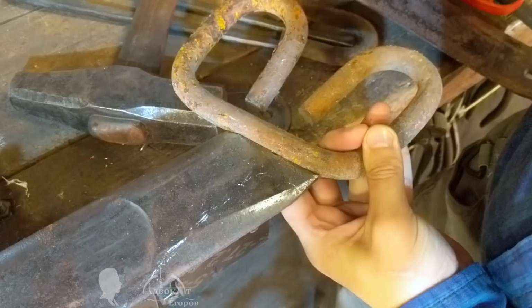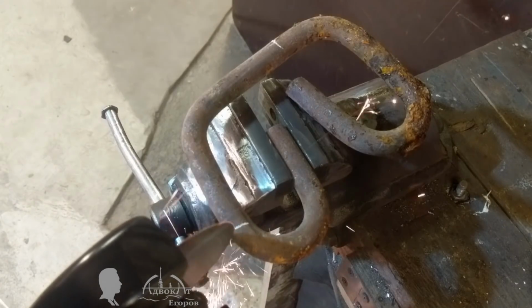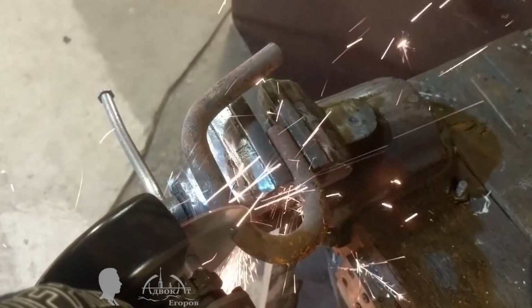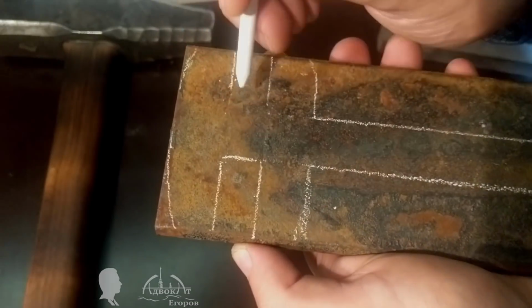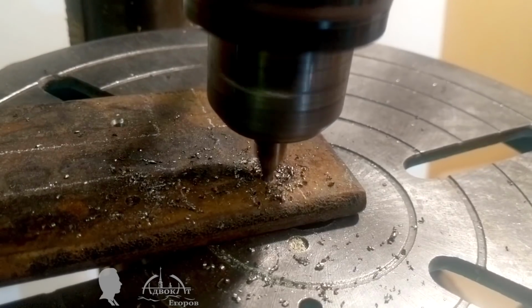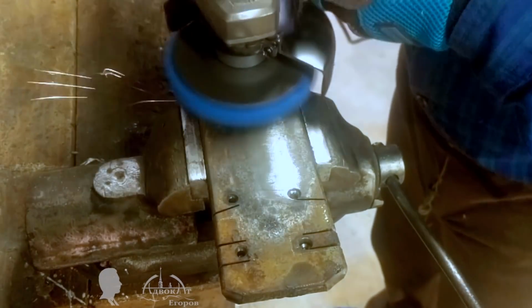Now I'm dividing the railroad clip into 3 parts. I used the central part as a mounting pin, the pivoting point of the future Cloggers Knife. As for the larger piece, I forged a tapered punch tool from it. Because the railroad clip is made from a spring structural steel grade 60S2A, it's not that easy to straighten it. This is why I had to make a blacksmith bending fork for this task.